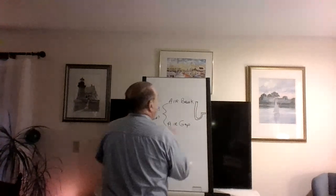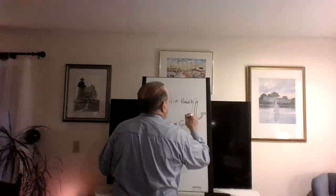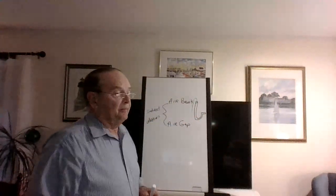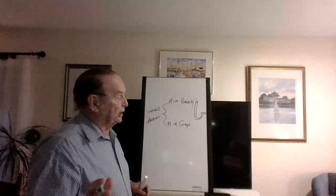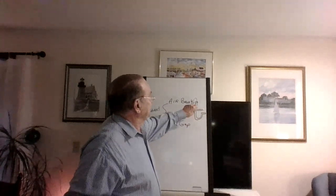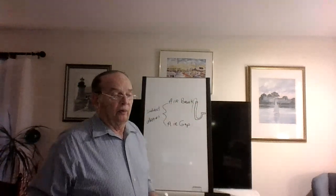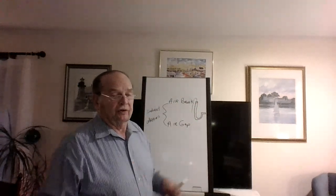Drop it into it. How far doesn't matter. We didn't talk about how far, but it goes in like that, and this would go down to the clothes washer. Okay? And like I told you, if you do hook it up for your elderly customer, be sure that this is hooked in there and it can't jump out when the water surges out of the washer.